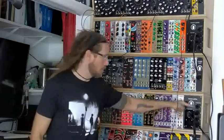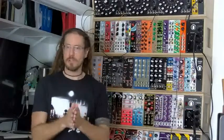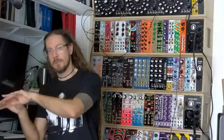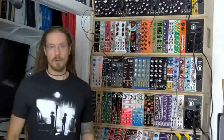So there's no jumping from one to the next. They're all going straight back to whatever that junction point was. Radial, radial, radial for your plus voltage, zero voltage, and minus voltage. And we'll mention that again in a minute when we get to my power distribution in my cabinets.